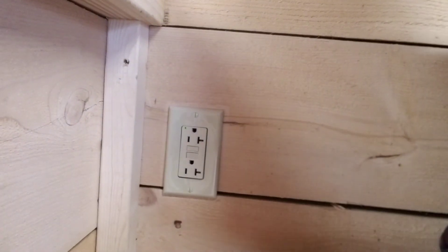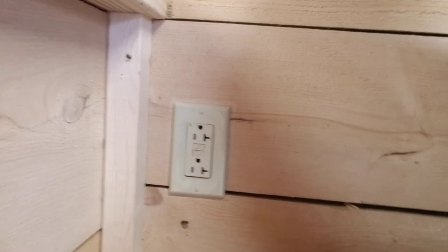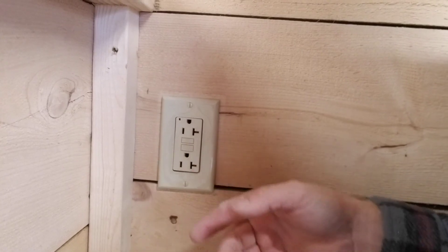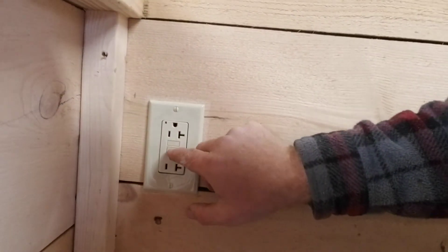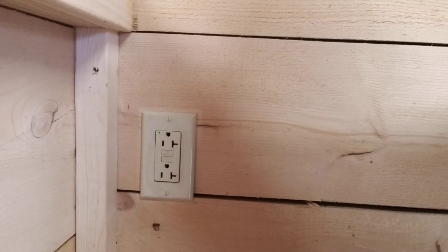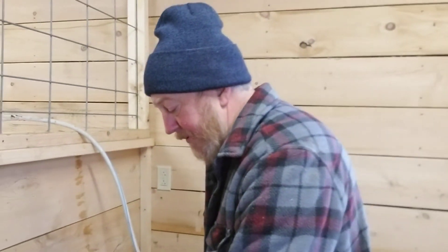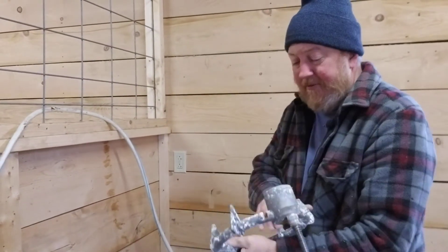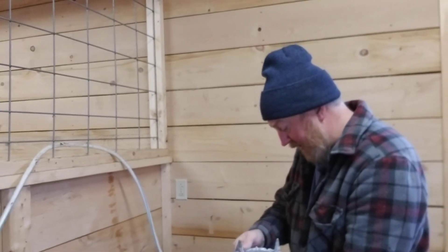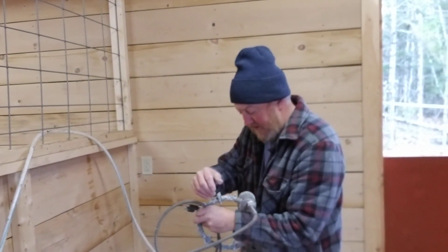There's our receptacle, and in the top corner is a green light telling us the receptacle has power and is on. There's a button labeled 'test' — if we push that, it goes out and the light goes out, telling us the circuitry inside works. Now we push the reset button and the green light comes back on — we've got power. You want to follow your manufacturer's recommendations and push that test button periodically; most recommend testing it once a month. This is a 1500-watt immersion heater meant to go right in the trough.